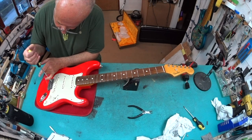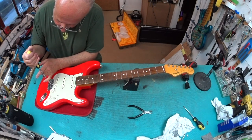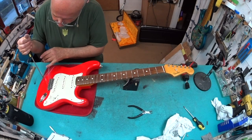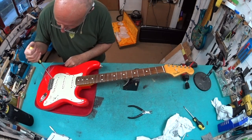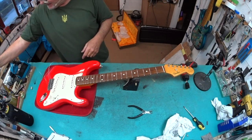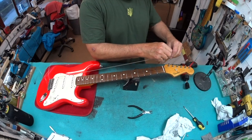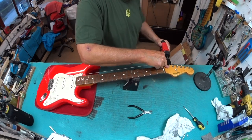So I'm just going to back them off to give the plate a chance to move more freely. Your screw heads really don't want to be touching this plate. If they're touching the plate, they're probably pressing it down at the front, which is absolutely not what you need. So you want that little bit of extra back off. It will do the job perfectly well, but you just back it off that tiny bit. You should then get a freer movement out of it. Okay, that's everything. So let's get into the wiring up thing.